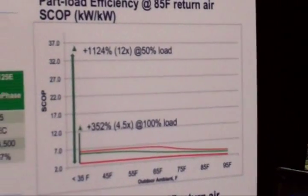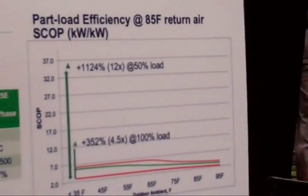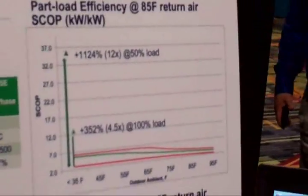For readers who may not understand this — maybe talk a little bit about the differences between different load factors and why the numbers differ for partial load versus full load. At partial load, various things happen. If I can unload like I do with the digital scroll, the evaporator coil actually warms up, so I don't end up dehumidifying the space when I don't want to. I don't have to turn the humidifier back on. So I've got energy efficiency built into the system because I don't operate it in a fashion that wastes energy — it actually does unload.